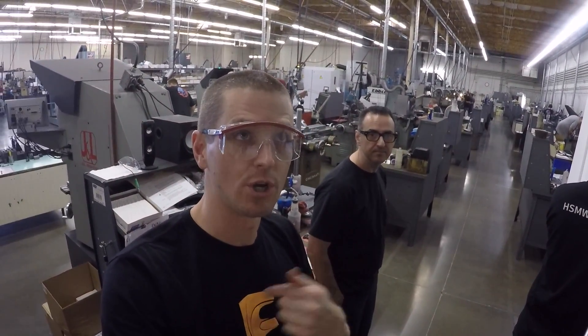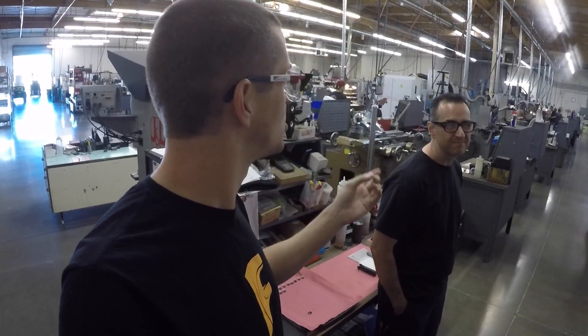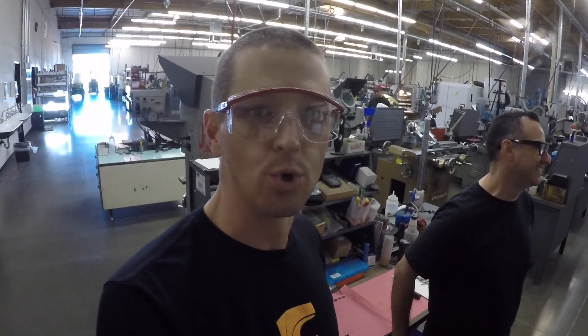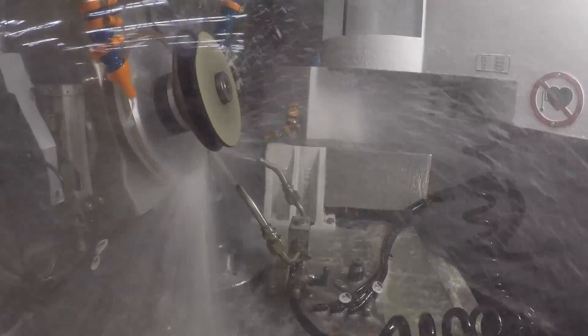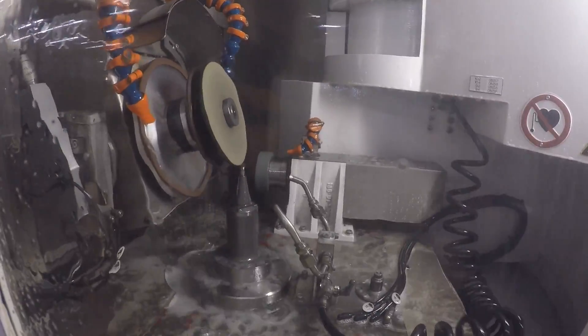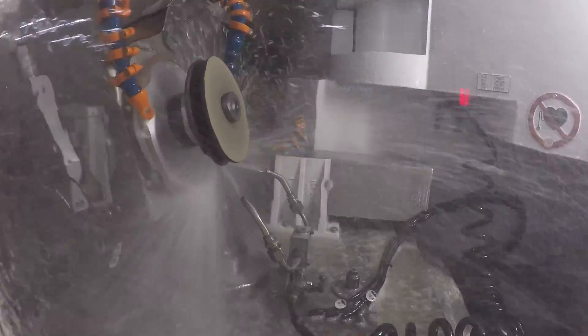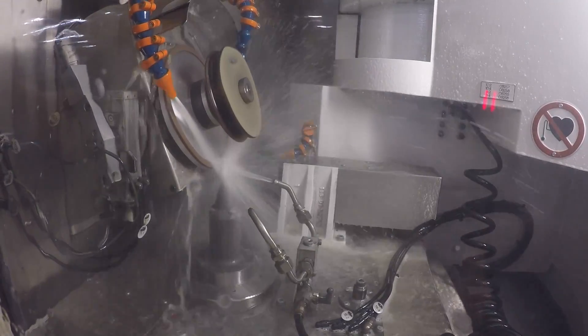There's a link in the video description to how we've used the Shear Hog on the Tormach — it's just awesome. The rule of thumb is six cubic inches per horsepower. Just an awesome tool for removing material, but the machine has to be running fast enough. It's really only limited by the machine. The UMC SS will only go 800 inches a minute — 820 or something. But then it still has to accelerate and decelerate, so that part wasn't a great example.